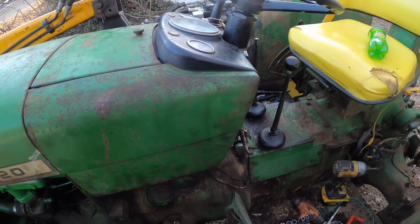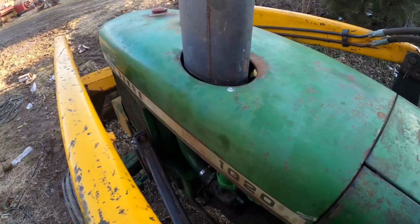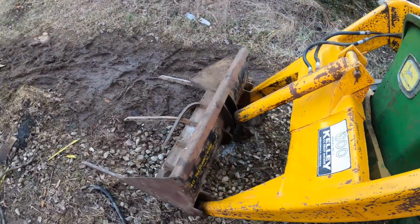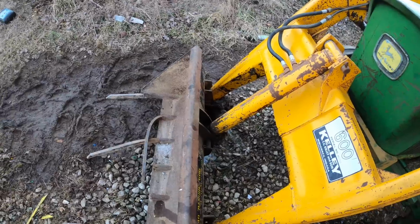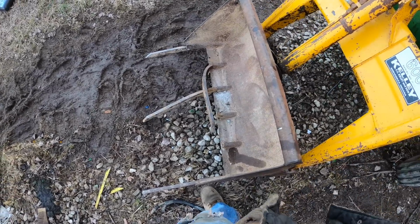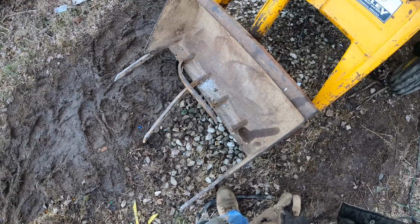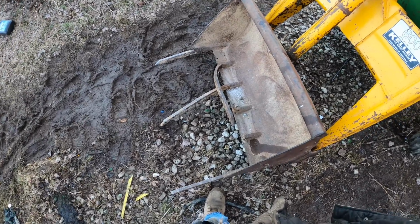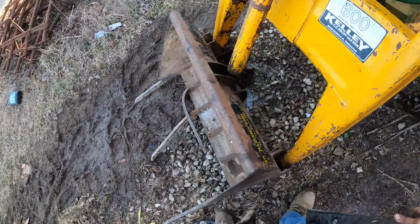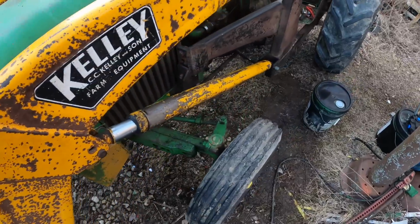And then, whilst I have the torch, I'm going to switch to the high heating tip, and I'm going to try to heat and bend back some of these tines. They're not going to hold when you do that. The temper goes out of them, but just having them straight ahead is going to be easier than having one folded over on itself. So if I can possibly do that to help him out. I can't replace them, because if I do that, then I'm going to start having to cut into the bucket. And that's an avenue I don't want to go down right now.